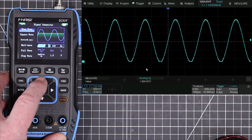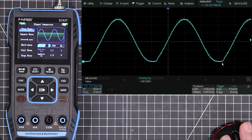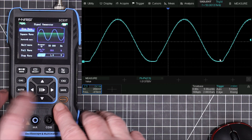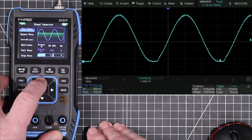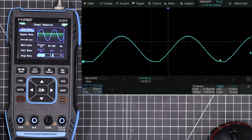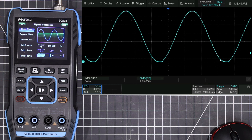The maximum of this is 50 kilohertz. At 50 kilohertz you can see that distortion at the bottom is a little more pronounced, and it's at the rising edge of the waveform. They're counting sine values until about here, then not updating the value much before updating where it should be — they should be able to fix that in firmware. At one volt peak to peak, it's very accurate in the voltage category. Bringing it up to 1.5, the scope reads 1.52. The maximum is 3 volts peak to peak and it's right on — the scope reads 3.01. So it's accurate in frequency and accurate in voltage.